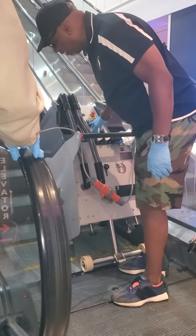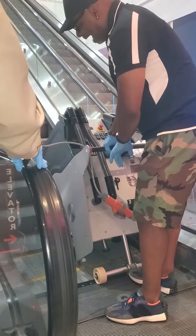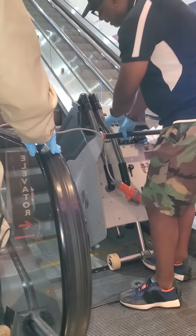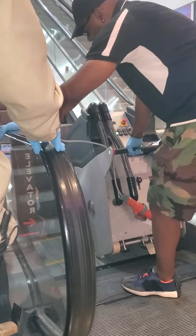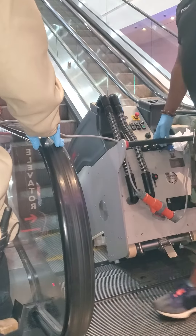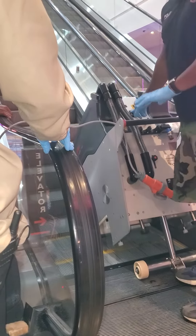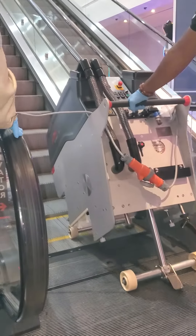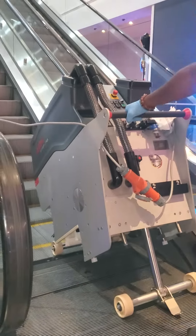You just want to raise it up a little bit, then pull your machine back so that your wheels are right at the step, then lower it down again onto the glide and slide it back. Then raise it up so your wheels are on the flat step and not on the lift like the curb, and just roll it back slowly. Remember the impact on the comb plate — you don't want to snatch it off. Just bring it right up over it and right off.